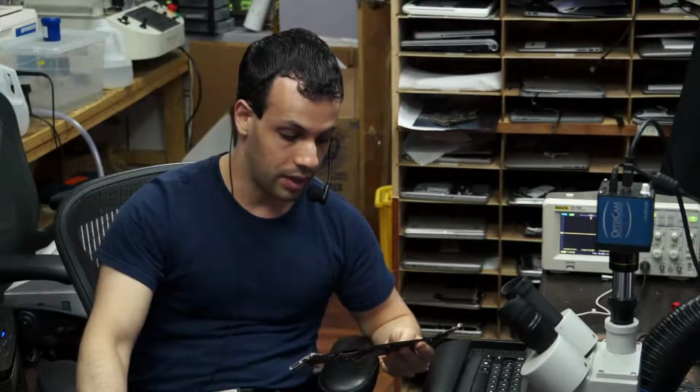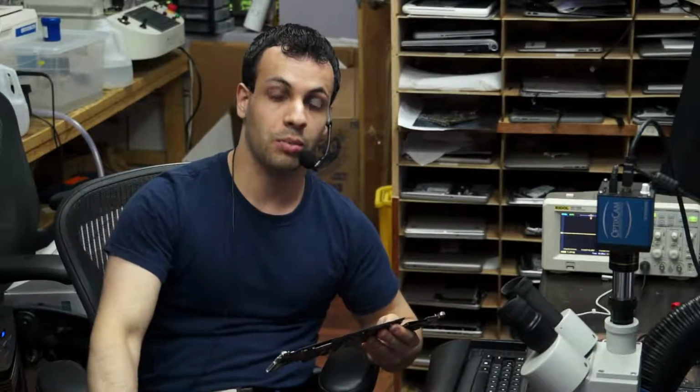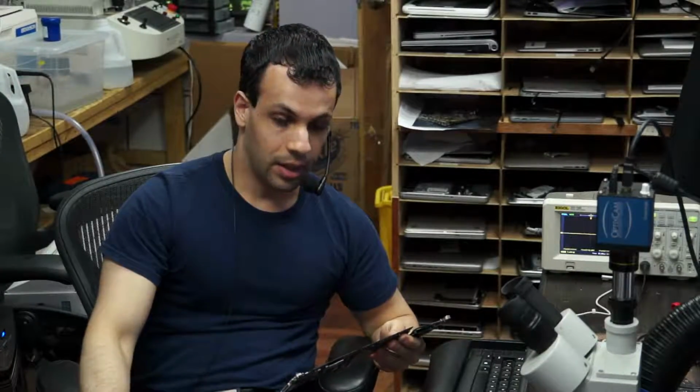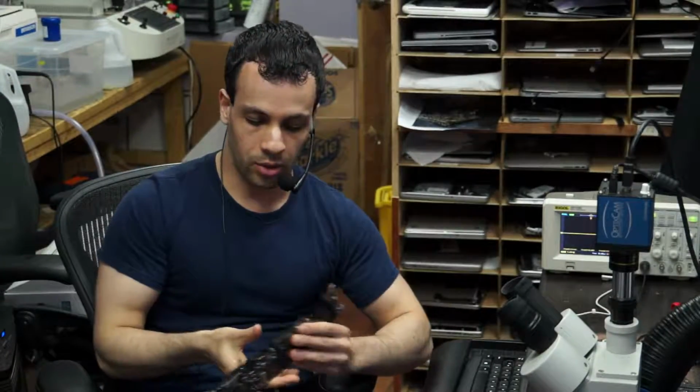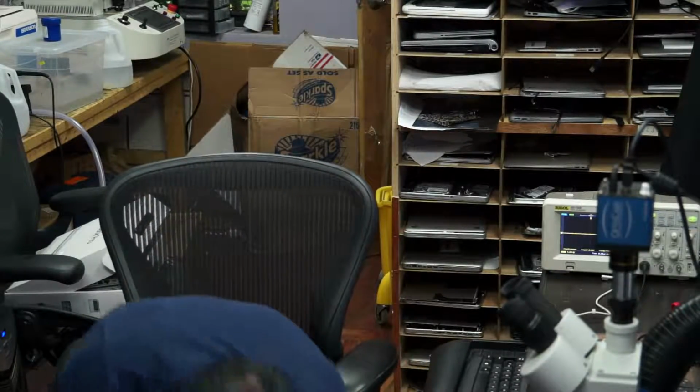When we look at the BIOS chip, or the SPI ROM chip, to put it more properly, since MacBooks don't have a BIOS, they have an SPI ROM, it was corroded. The little traces were corroded going between the BIOS chip and the resistors. And when we replaced that, I didn't even check to see if we had a sleep signal anymore. Because I know we do, because we have 5 volts where there's supposed to be 5 volts, and the fan spins and turns on.